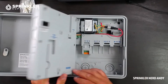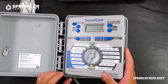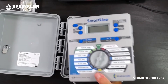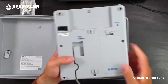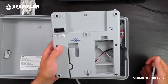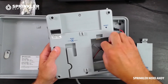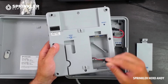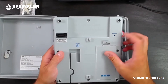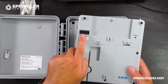Let's get to the good stuff, which is under the hood. I'll go ahead and pop this open. Most controllers let you remove the face panel, so let's pry it back ever so slightly and pop it off. On the back of it we've got a 9-volt battery compartment for battery backup right there — you stick the 9-volt battery down in this compartment and hook it up.